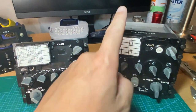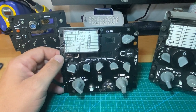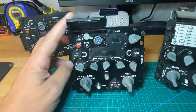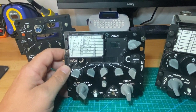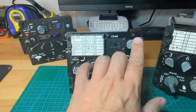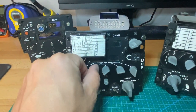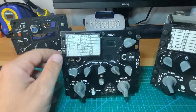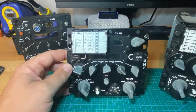What I did was I purchased one of these HaveQuick 2s before and I ripped all the switches and knobs out and basically populated this, making it a more aesthetically pleasing replica. There's nothing really wrong with it — it works great, looks great. The only issue I didn't like about it is these four switches here and the channel preset are just cheap eBay encoders. The knobs are real, but turning them is just kind of flimsy and doesn't really feel like any type of mil-spec hardware. So eventually I want to rebuild this one with something a little better.